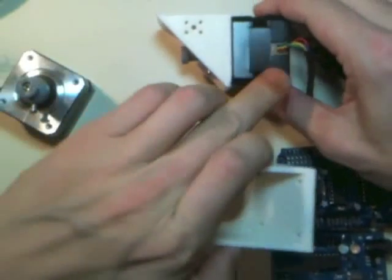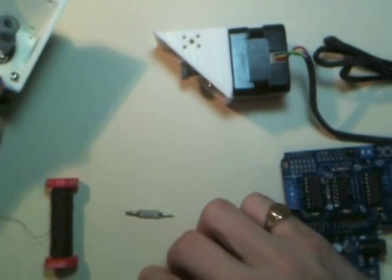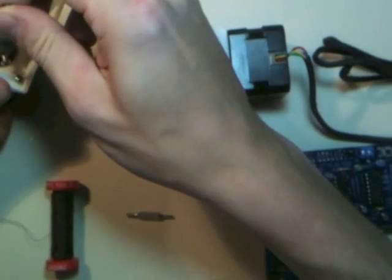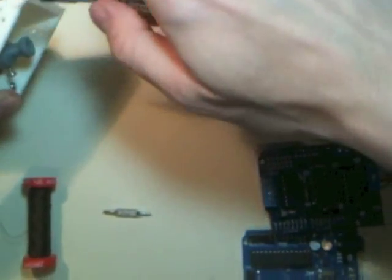Attaching the motor mount — you see here how the wire is coming out the side and not the back? This is so it doesn't interfere with the board. I want to do the same thing on the opposite side but in a mirror image. I've lined this up and I've already started my screws. If these holes aren't big enough for your M3 screw, a 7/64ths bit will fit just perfect. Getting the one in the back is a little tricky, but once you get it started, the rest is pretty straightforward.